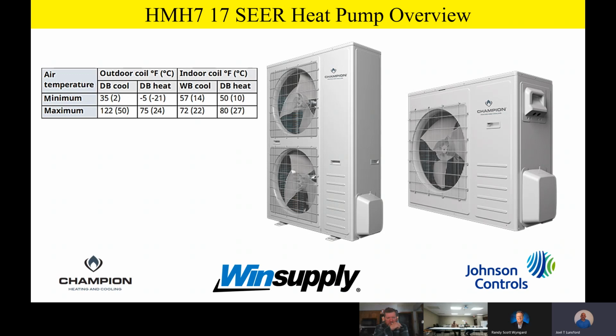And then you look at the outdoor temperature maximum, which you guys probably would never see 122 degrees in your area, but who knows? Maybe one day you would with global warming and all that kind of stuff, I guess. But the maximum temperature is 122 and 75 for the outdoor coil in heating and cooling. And then the indoor coil, 72 maximum wet bulb on the indoor coil for cooling and 80-degree dry bulb for heating. We get asked this question quite a bit, hey, how far down can I cool without any kind of low ambient kit?